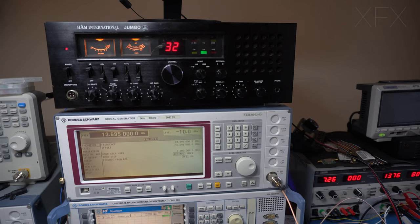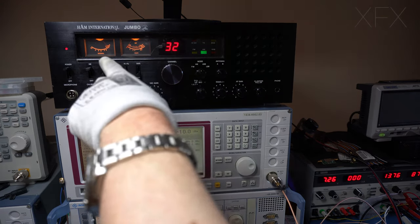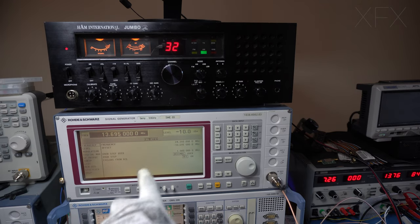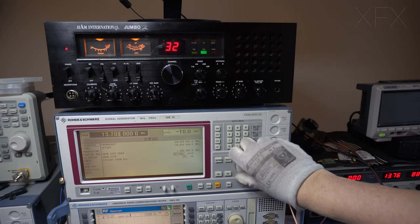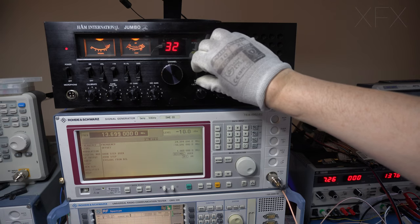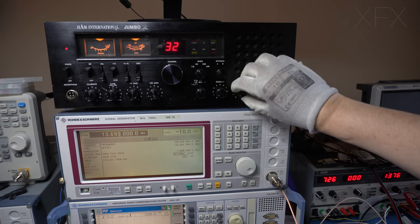Okay, you see what I mean about shortwave radio stations can just pop up. So we're just outside of the 20 meter band here, and if that gets into your mixer on the 20 meter band, which it will be doing, things like this start swamping the mixer. It's on AM. That strong, even the FM's demodulated it.